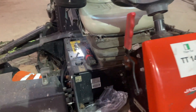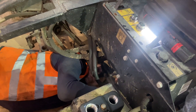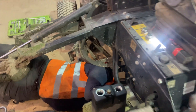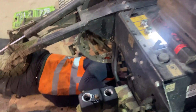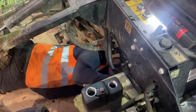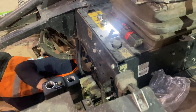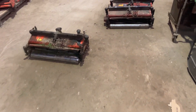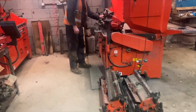James is busy on this one at the moment, he's down under there. James just put the hydraulic filter back on, then he'll be topping up — he's got the drain holes here ready, and obviously it helps the oil drain out better if there's no plug in the top. James doing a great job there. So I think what we'll do now is go and have a look at the business end of the unit, the cutting units, and we'll go and catch up with Ian who's doing the grinding.